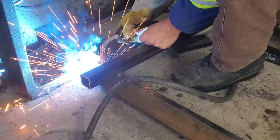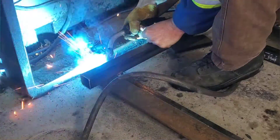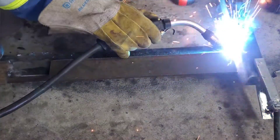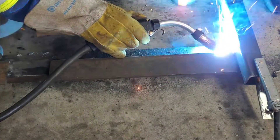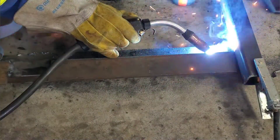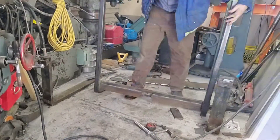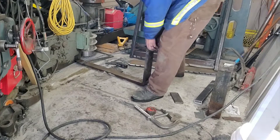Now it's just a matter of putting the hood down and giving her welding. I'd weld one corner, then move over to the other corner and check it because I didn't want to weld too much in one spot. For the inexperienced guys: when you're welding something, you've got to think of everything as plastic. When you weld something tight together it actually contracts — it expands with heat and then contracts smaller than it originally was. So you're going to wind up with a trapezoid or something if you don't pay attention. In some cases you can actually use that welding contraction to your advantage.